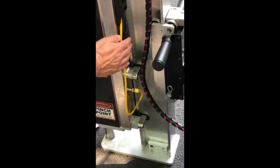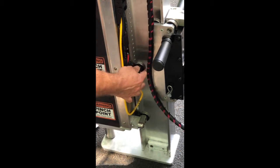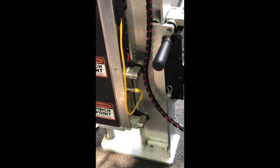This is where the electrical is connected. On each side you have roller bearings that travel up and along the beam, and your control wiring connection is the yellow cable. We're going to disconnect those, but first you want to make sure your power is off before you start disconnecting the wires.